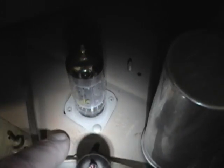Okay, let's take a closer look at these tubes. I see that there are numbers stamped on the chassis for the tubes, like this says 6AU6. Some are printed. There's another 6AU6. In some cases, there are multiple numbers, like this says 6S4 or 6W6. And I notice that the socket is a little bit odd looking. A 6W6 is an octal tube, I believe, so I guess this was like a factory option depending on what tubes they had available. They could either go with a 9-pin base or an octal base.